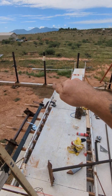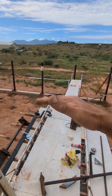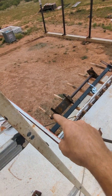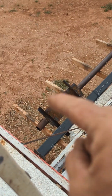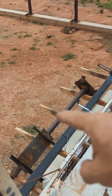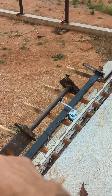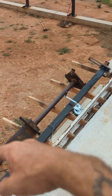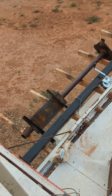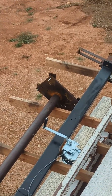The manual winch picks up the second part of the steel. I have the remote control that lifts one side up, and then I crank the winch up on the other side and line it up with the string line. There's a steel plate right there — you can see it — and what I do is tack weld the steel to that plate while it's being lifted by this winch. This plate is welded to a piece of steel pipe that is welded to a railroad track tie plate.